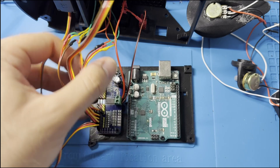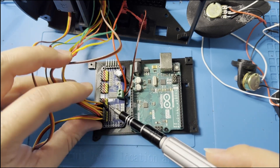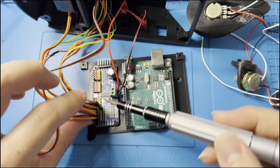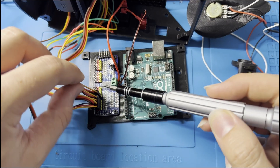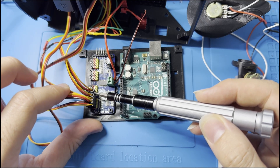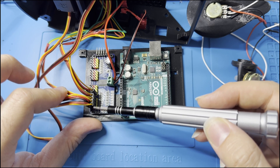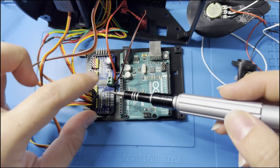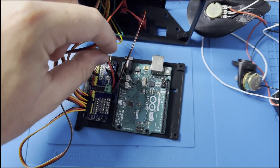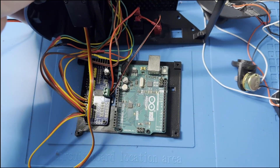Now you can see the wires and cables. This is the servo motor driver board and this is the Arduino Uno. Here you can see the cables coming out from the arm to the driver module. From top to bottom: this is the hand or gripper servo motor, which is a micro servo; the next one is the wrist; the next is the elbow; then the shoulder, which is a 20 kilogram servo; and the base, which is another standard servo. You can also see the complete pin map at the end of the video. These two are the power supply wires.